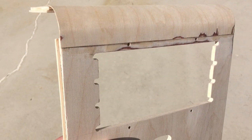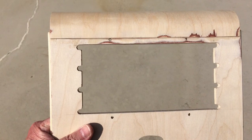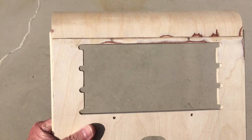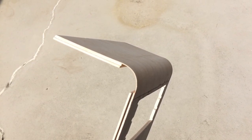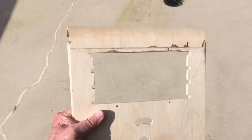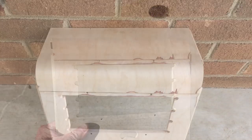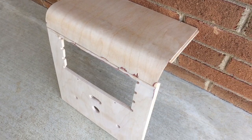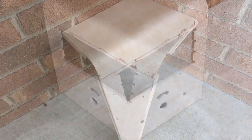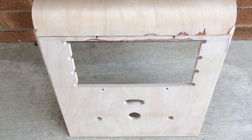You can see the results here of what I've got. There'll be some additional sanding required, and then we'll fill that in with some epoxy filler as well, just to make everything nice and smooth where the two pieces join. It's kind of an unusual step, doing it this way, but after doing the dry fit I think this was the best way — it was going to be very difficult to get clamps back in there and get the front and the top piece attached to each other.